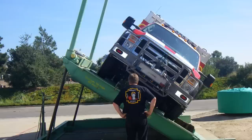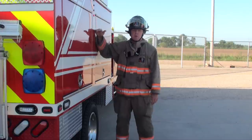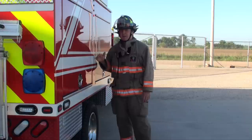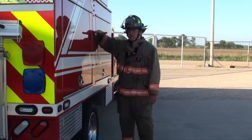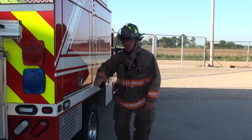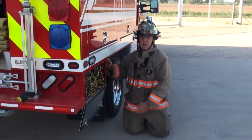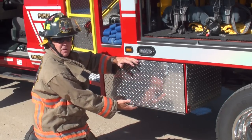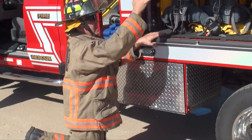Another key thing on construction is your center of gravity. We're holding the record on our tip table — this truck registered at 37.2 degrees and broke over at 39.3 degrees. The way we get the stability of this truck is number one, get our CG low. Here's the top of our water — this truck is carrying 400 gallons of water. Our heavier stuff like cribbing, we store it down low. Notice where the gen set is located — it's down low, not inside the box raising our center of gravity and taking up room.